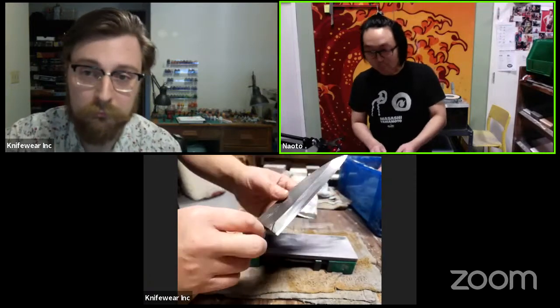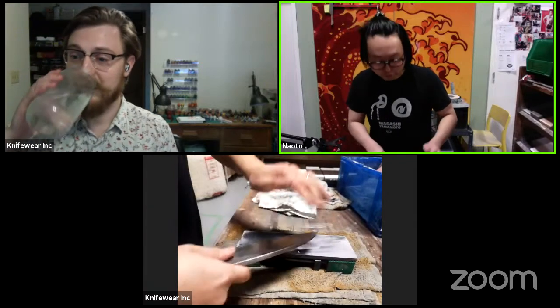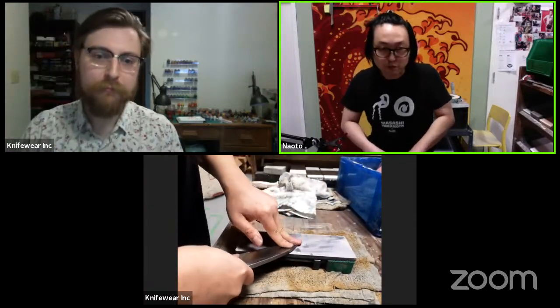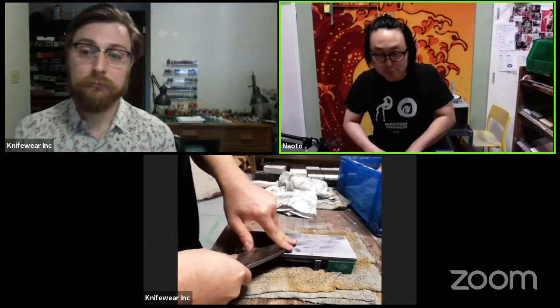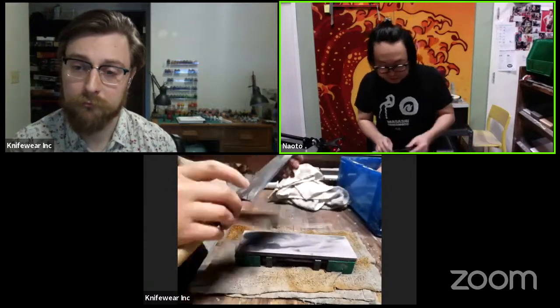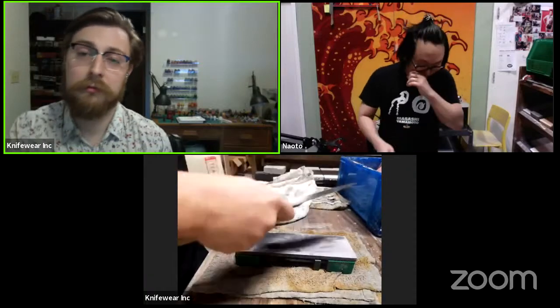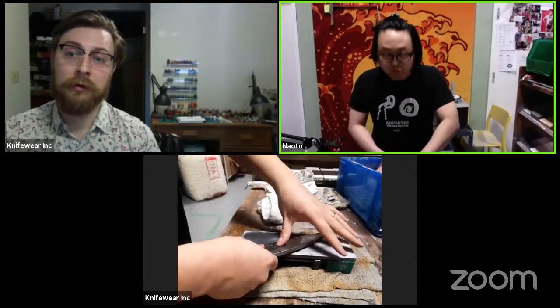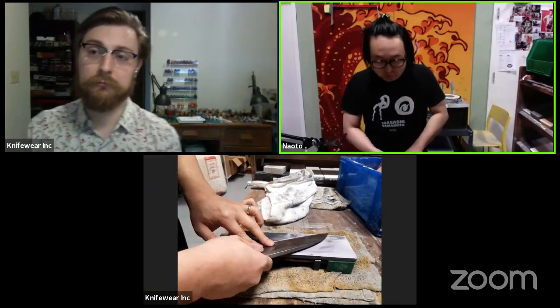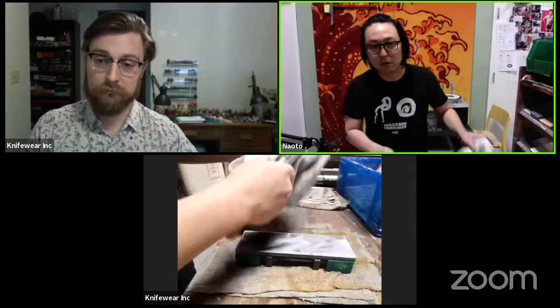talk. So right now here, as you can see, I sharpen one. Say for example on the top here, I put the pressure down at the tip and a tiny bit on the bevel part, so it's got a nice convex. I'm still missing this part right here, hey? Wow, no kidding. So this part, when you're sharpening and see where it has not been touched on the stone, make sure you just change the angle. A little bit of angle change will get to that.